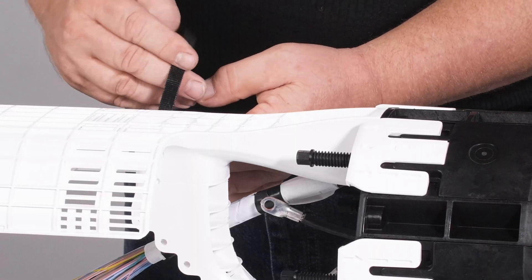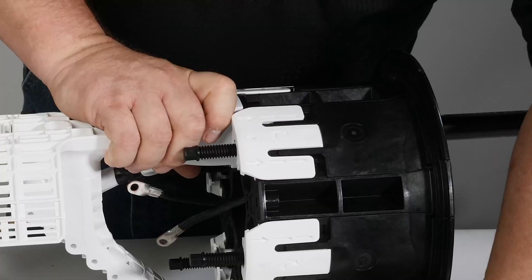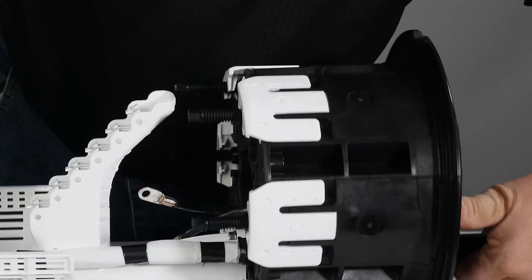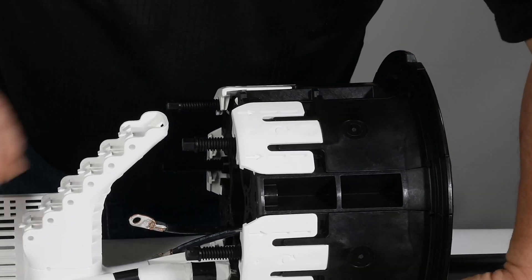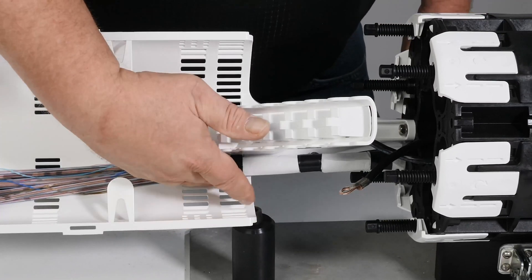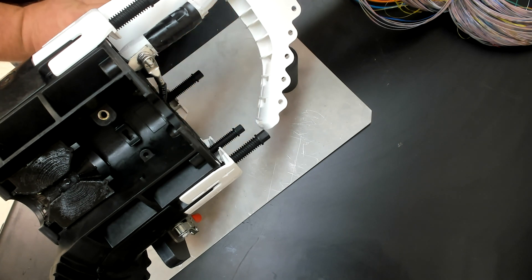Install material near the Apex basket yoke to secure backbone cable to the basket using Velcro or tie wraps. Once backbone cables have been installed and sealing wedges are secured, release the Apex closure from the stand and rotate it 180 degrees with the basket facing down. Be careful not to damage any cables, tubes, or fibers while rotating. Secure Apex with the basket resting on support and engage locking tabs. Secure fiber, cable, or tubes on the basket close to the yoke using Velcro, foam retention, or tie wraps. Tighten all six gel compression screws prior to final assembly. Secure the Apex ground cable to the shield bonding kit before or after wedge placement.